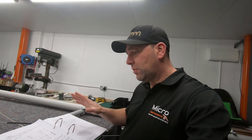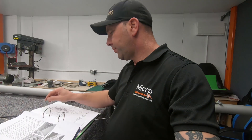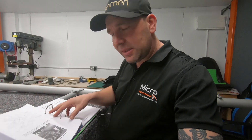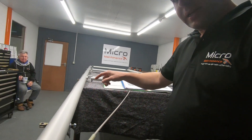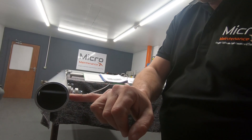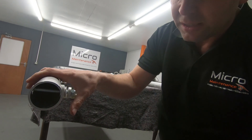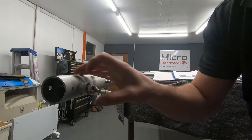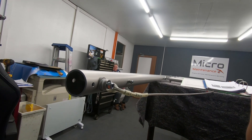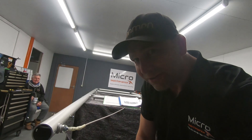If you've been reading the manual, one of the first things it refers to is certain saddle washers shown in figure 414 that might foul with the brackets. This is on the trailing edge tube, and it's this saddle washer here — where the rear attachment fuselage bolt will hold the rear trailing edge. The bracket may foul on this saddle washer, so the manual says it needs to be cut down or shaved by around 2-3mm. So we're going to whip this off and file it down 2-3mm so it fits nice and snug.